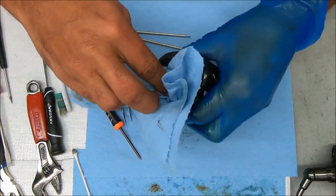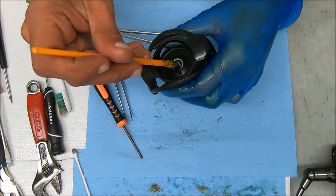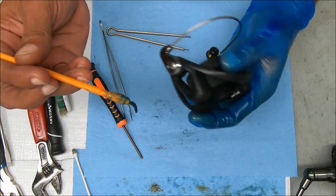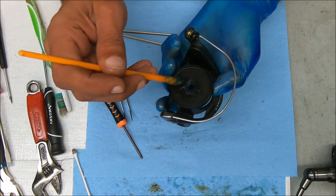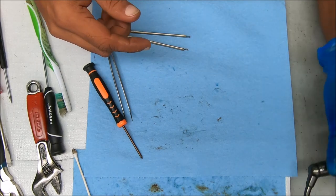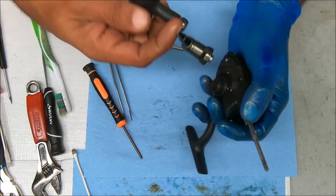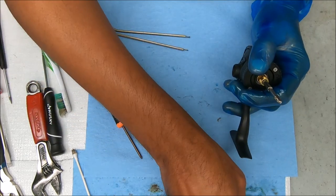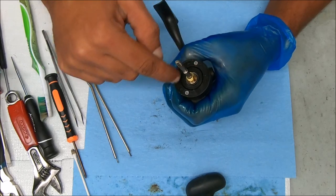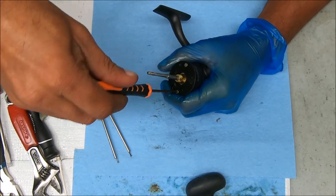While I'm here, I'm going to add some grease around here, inside the hole on the bottom of that gold piece, and just somewhere around there. I'm going to back the handle off by going counterclockwise. Now let's get to the top part — we're going to undo those two screws. There are a couple of things working inside here that we have to pay attention to.